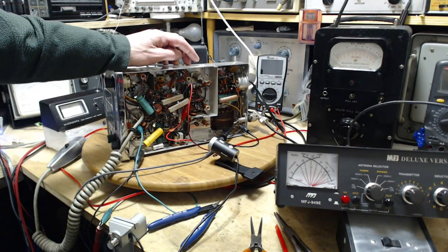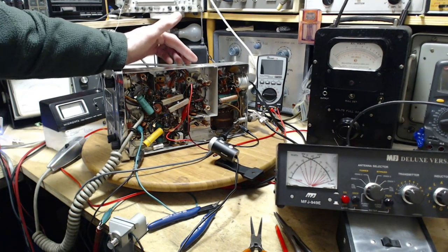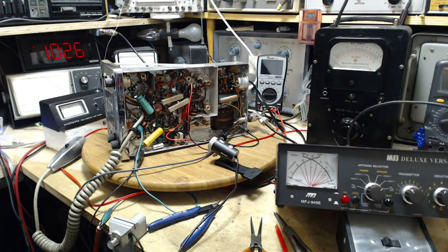I have a big concern here. I'm smart enough to know I'm stupid — there's a lot to know about dealing with these transmitters and my experience is low. I have a good general foundation, but there are issues related to transmitters I've never dealt with before, like neutralization and class C operation. When I first read about class C operation in the manual, it made me scratch my head, because the tube being operated that way is not conducting most of the time. So I'm going to put up the schematic and go over what I've come to understand about the output of this radio.